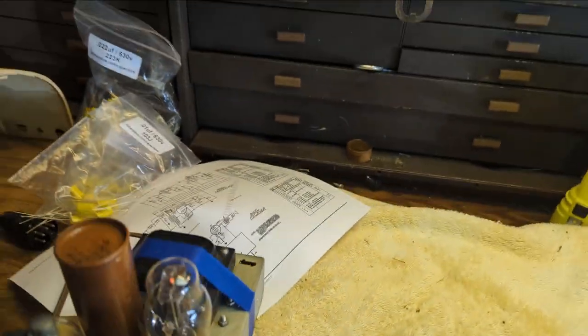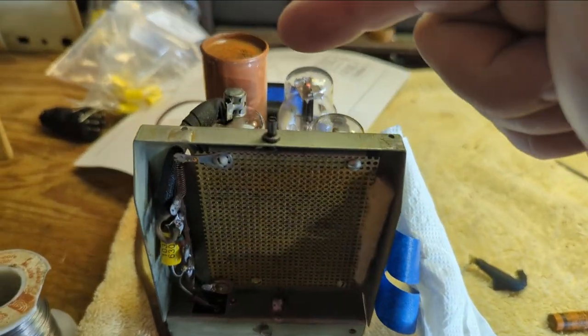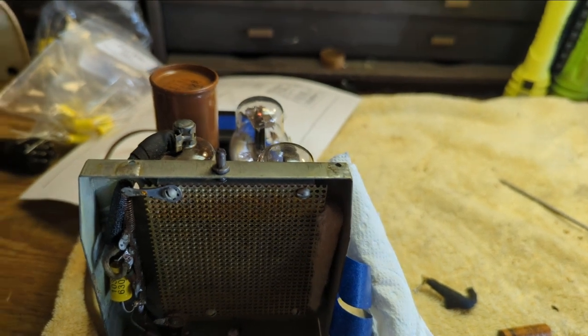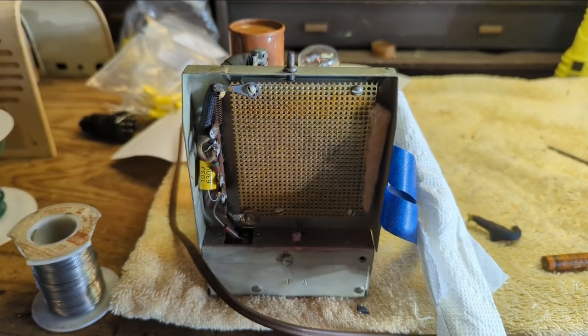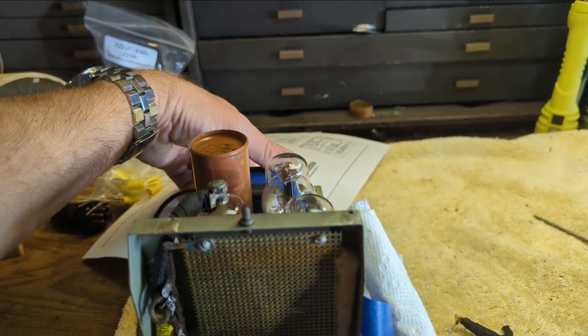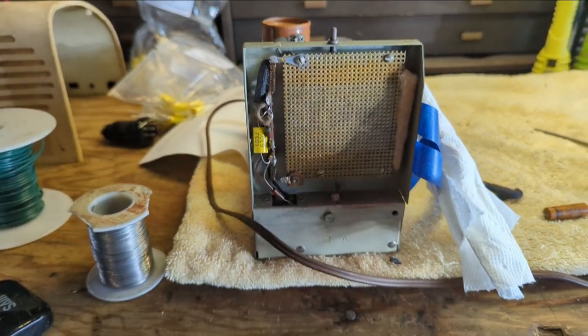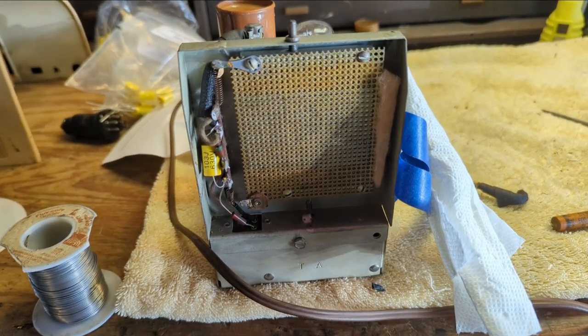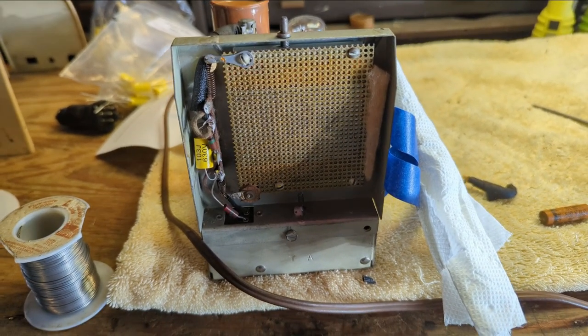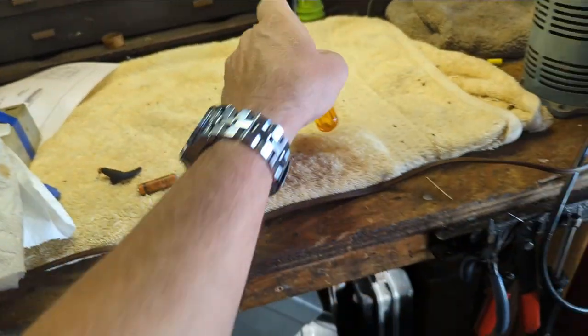Okay, well, this is definitely transmitting, because when I touch the grid of that tube, it's picking up over there. And so the batteries are completely shot, so there's no charge being applied to the microphone. And the microphone elements, I'm not sure if they're good. So this might be a real big disappointment, having spent so far 3 days working on this thing.